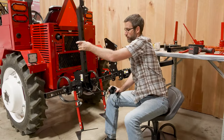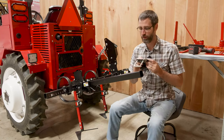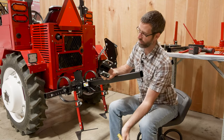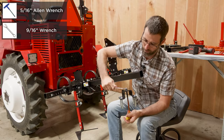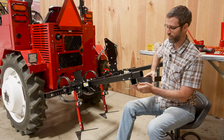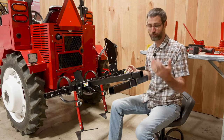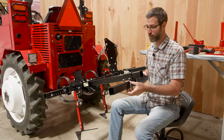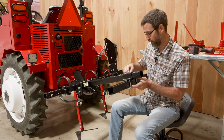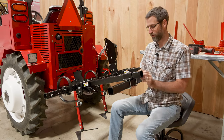We're going to continue on with this row and bring back our trailing arm, with a reminder about using those springs as a tensioner. We're going to add the cross clamp, which has a nice feature using a cap head screw to index in so it doesn't pull back. You tighten it down with an Allen wrench and a regular wrench. Then we add our cross member through. One thing I like about the mod bars is these holes — they serve as a measuring stick, so I can center the cross clamp without even pulling my tape measure.